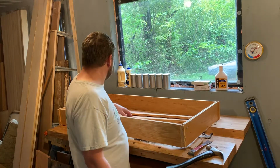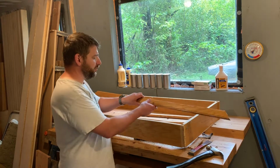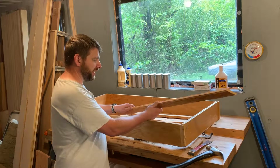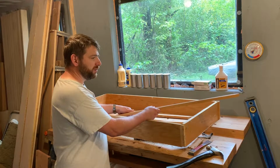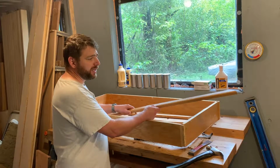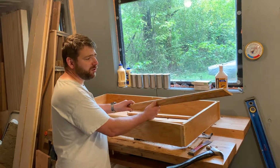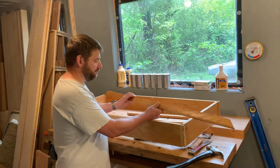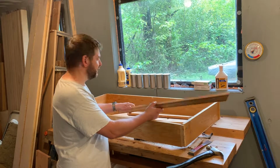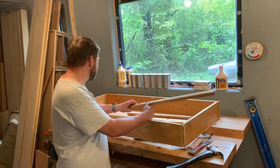The moldings, though, I think are reworkable, and I think with a bit of cleaning up and hitting them with a router, putting on a more contemporary flat bevel finish instead of the cove on the edges, that edge treatment will make them look pretty decent, and we'll see if we can't maybe reuse these parts.